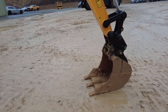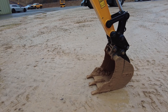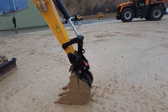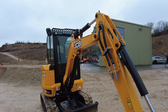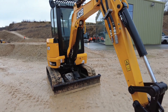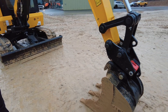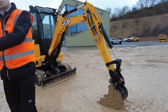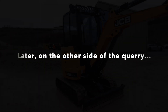Trailer towing weight is really important for this machine. With an operating weight of 2,550 kilograms, you can fit this machine and three different sized buckets on a trailer and tow it all — including the trailer — under 3,500 kilos. The buckets have had some weight taken out; the profile has changed so they can hold more material. The transportation hooks mean you can pick a bucket up with the grading bucket and effectively move all three buckets with the machine on site, which is a more common application we see from our customers.